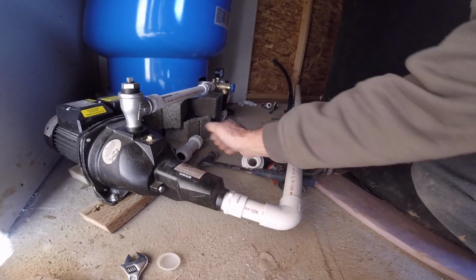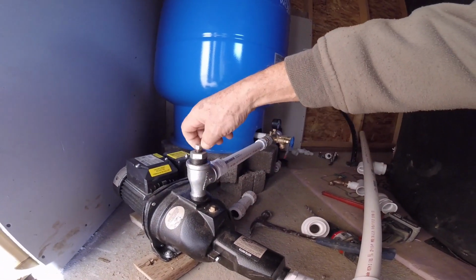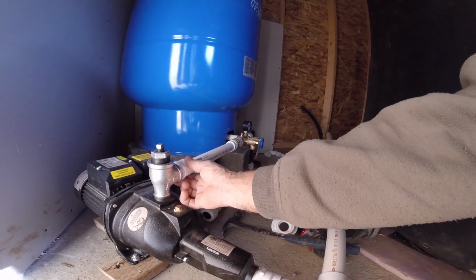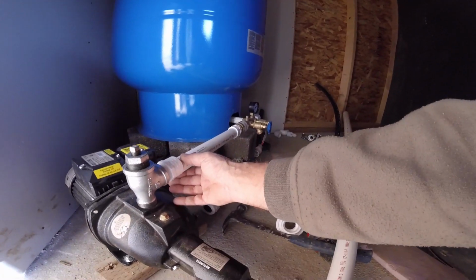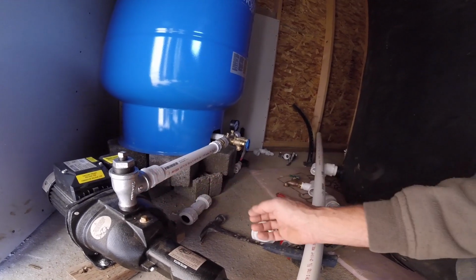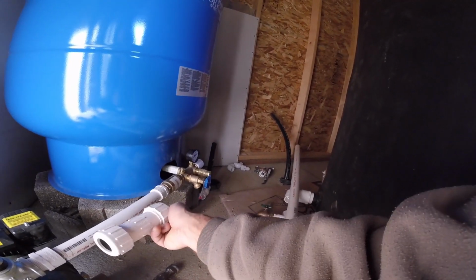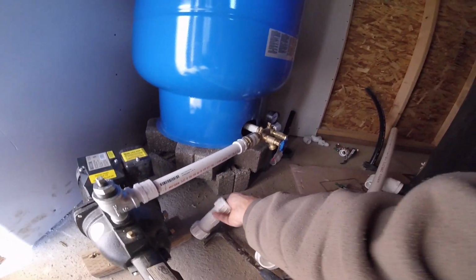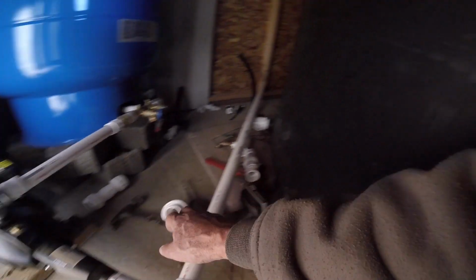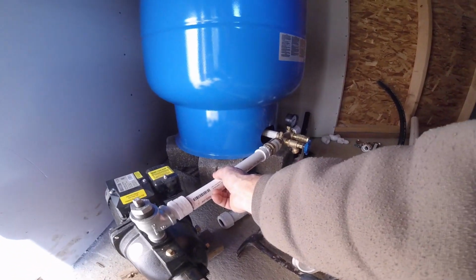This pump is mounted to the ground. I got my priming tee right here, which will mount up, and that's in close proximity to where it needs to be. I'm lined up with this, and again I'll have kind of a flexible joint here in case that tank rocks. I want it to kind of be able to move a bit. Not so much worried about this rocking or my big tank here, but this is gonna wiggle a bit, so I don't want that so rigid.